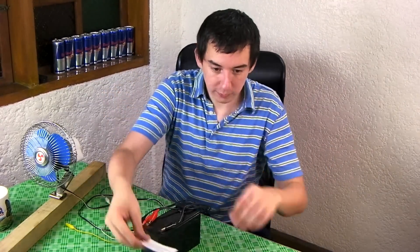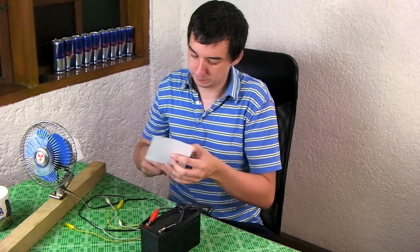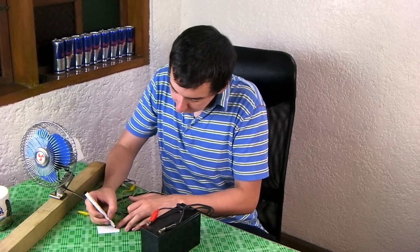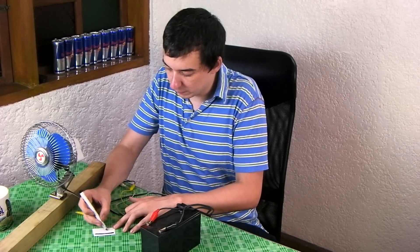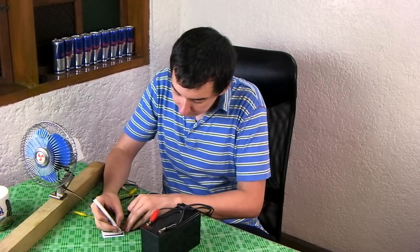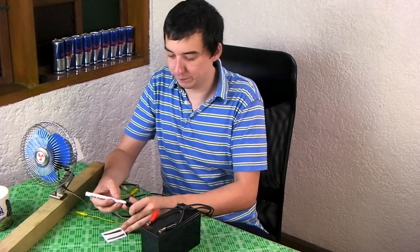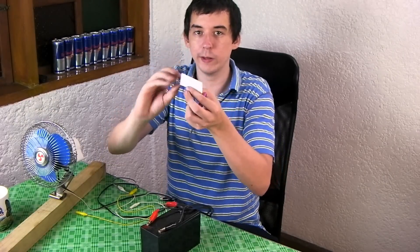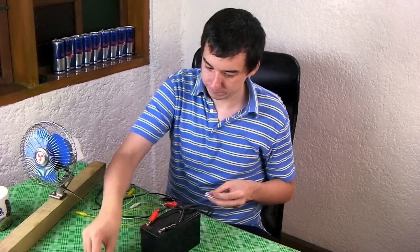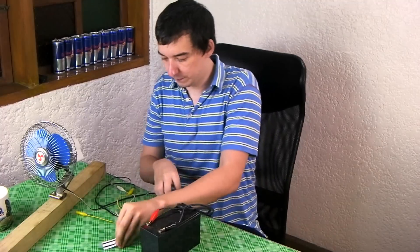But I know it can power this fan, so let's try again but use slightly thicker traces. I'll cut a piece of the paper and draw traces onto it. This time I'm going to make it a little bit thicker — I'll draw the two lines and then go over them again after a few seconds once it's dried. I'll just trim the paper so that the traces go all the way to the end. Here's our new one — the old one is basically dead, you won't be able to put any more power through it. So let's connect our battery.